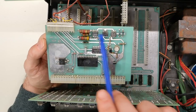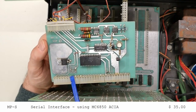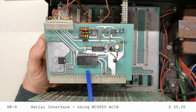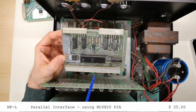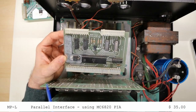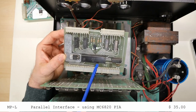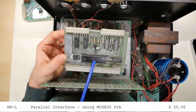This card here is an MP-S, another OEM card from Southwest, and it has a baud rate selector up to 1200. The MC6850 chip on this is actually a proper serial UART chip, not a parallel chip that's bit-banged, but that hard-coded ROM will only work with the other one so we can't get 1200 baud for the console out of this thing. The next card is the MP-LA, which I'm pretty sure is a parallel I/O card, much like the user port on the VIC-20, PET, or Commodore 64. This uses the MC6821, which is a very similar or compatible chip to the I/O controllers on the PET for the keyboard, allowing you to toggle I/O pins in software for things like printers, LCD screens, sensors, or other external peripherals.